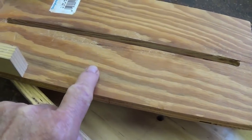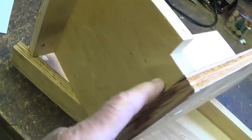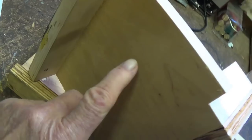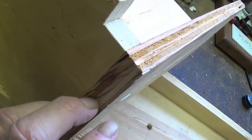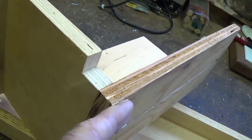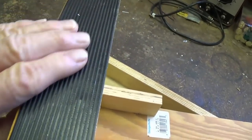So now we have the floor of the sliding unit, and then we have the end piece of the slider unit, which you see perches right atop the floor, and it is 8 inches wide, just like this end, but because it's perched up on 3/4 of an inch of plywood, it's only 7 1/4 inches tall from here to here. That means that from the floor right here all the way up to the top, it's exactly 8 inches tall, just like the other side. Otherwise, you're going to have your chassis at an angle. These two surfaces here have to be at exactly the same height.